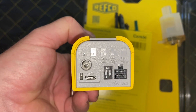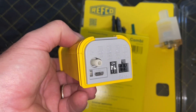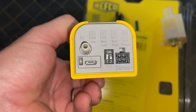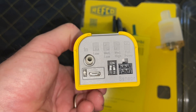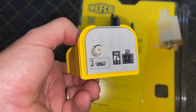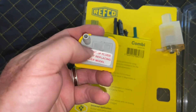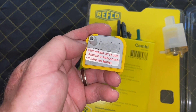You can see you've got a port for your sensor, your inlet where you bring your small hose pipe into the actual pump from the reservoir. Just underneath is the USB port where you can plug in and connect it with Refco software to determine pump alarms as well as data of installation for warranty. There's the LED which will blink and illuminate on the discharge side. Underneath here is your power connections, and underneath that little cap is the 10 amp glass fuse.